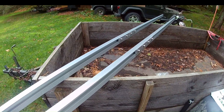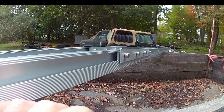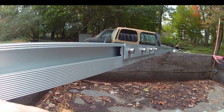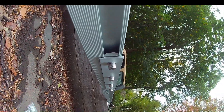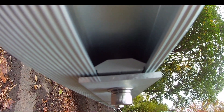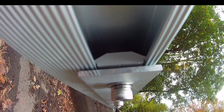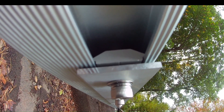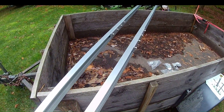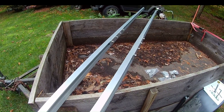Alright, small progress. The two long rails that you're going to have here have a center splice unit — pretty easy to put in. One thing you want to do is make sure — you see that little rail there, the center piece? Make sure that those lips there are equal distance on the top and bottom, so that when you tighten it, it holds it tight and straight. Other than that, it gives you nice long rails so you can put panels on the top and bottom rails. I'm going to plug along a little bit more and I'll be back in a bit.